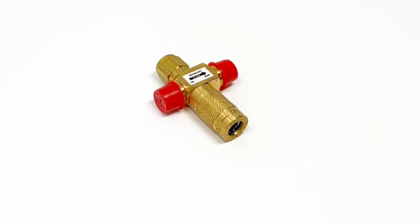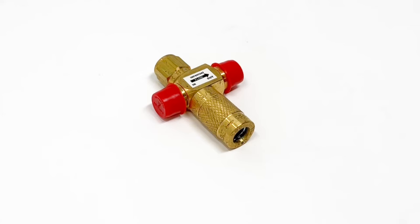This has a setup that basically looks like pressure in and pressure out. A lot of people like to screw with unloaders — should you? No. Once we set it, you shouldn't mess with it. All of these have an adjustable valve. A common misconception is that people use these to adjust pressure, and they never should. Even on the little Home Depot and Lowe's units — same thing. Set it and forget it.